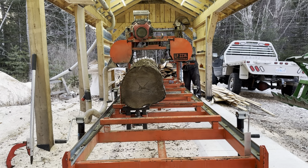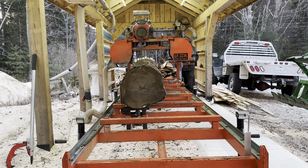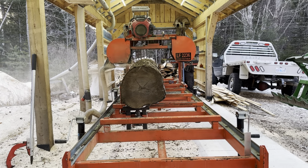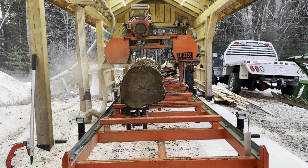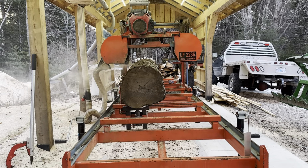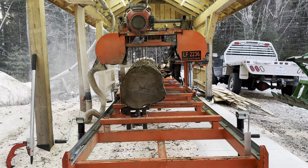But now that it's dried out some, I had the opportunity to be able to move it. So I need to make some tabletops, some live edge tabletops on either side of the pith of this log. So right now what I'm doing is, I forget what the actual dimension was now, it's a few hours ago, but I had measured down probably somewhere around 18 inches, and I'll take a slab cut off the top, and you'll see I'll just lay the slab alongside the log right on the deck.